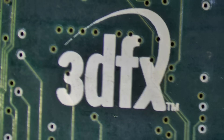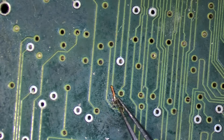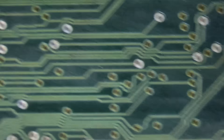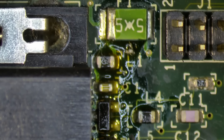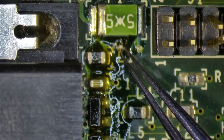Okay, let's have a look at the Voodoo 3. This is the back of the card — just a brief scan to see if I can spot anything suspicious. We do have something here, so we have to see where this comes from. Probably this is the memory section on this side. Otherwise I don't see anything of concern right now. Let's check the front of the card. We already have signs that someone worked on this card — this is hard flux, and there's also some solder left over.